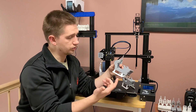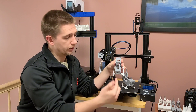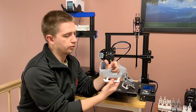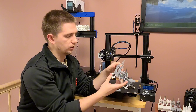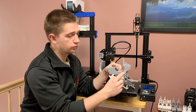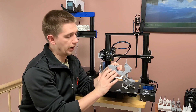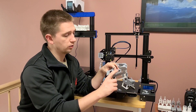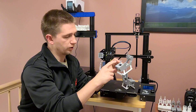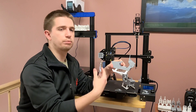The main screws I stuck with were for the bearing blocks, the set screw for the tail boom compressing it together, the motor, and then your landing skid. I started off with the top frames and the boom block, removed the frame adapters, then added the bottom frame, put in the motor mounts, and then added the flight controller tray as well as the battery tray — slowly building and building.